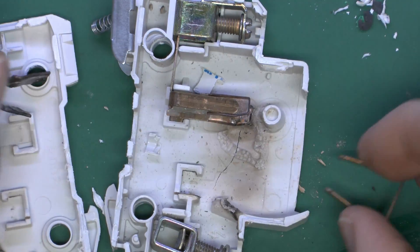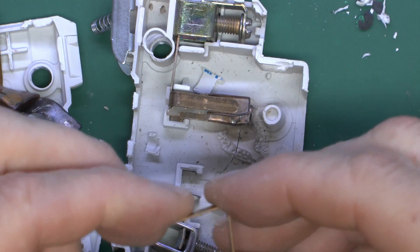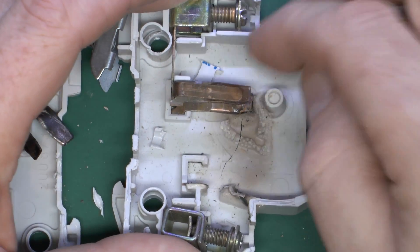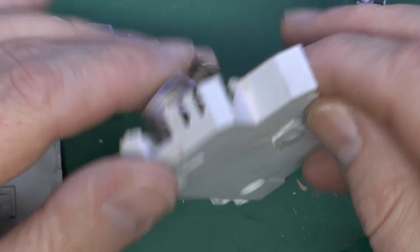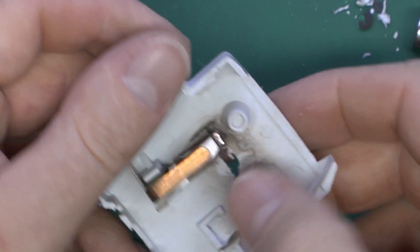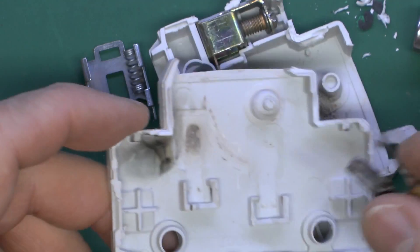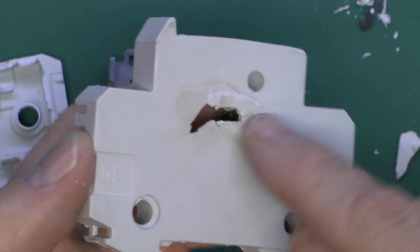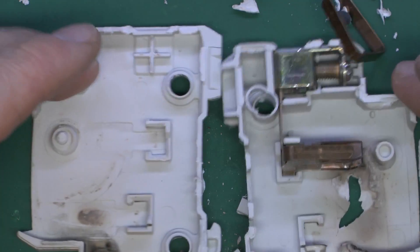It's softening the metal. These bits I think are actually copper or something like copper when in working order, and there's some sort of spring to secure it in position. We've got inner copper contacts and an outer loop of spring. You can see on the side the extensive damage to the plastic — there's actually a crack there and it will break through fairly easily. It's gone extremely brittle, and you can also see burn marks where it's obviously damaged the plastic on that side as well. This thing was only noticed when it had actually failed, and you can see it's already basically bulging on the side. Clearly it's been overheating to an extensive amount for a very long period of time.